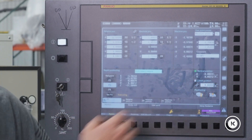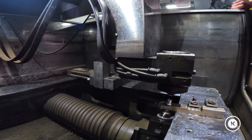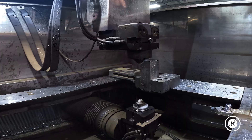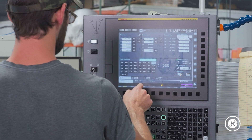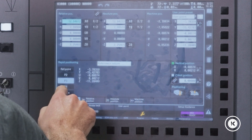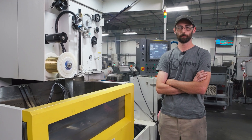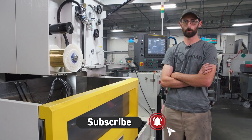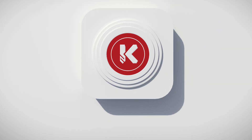This is more the sort of thing the setup person will configure and then the operator just has to run it. So we zero out the Z limit position and now it'll come over and drop the head down. It's as simple as that. There are a lot of things that can go wrong but it's really basic: you're just storing your machine coordinates and recalling them. Measure points have no Z-axis movement; user points have Z-axis data. Whichever one works for you is the one you should use. So there's the difference between user points and measure points, how to set them, how to recall them, and some applications for either one. Now that it's documented on YouTube, you don't have to come get me every time. If you found it useful, leave a like and get back to work.